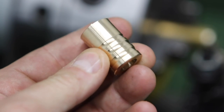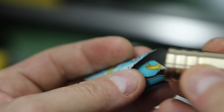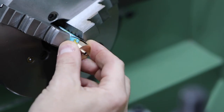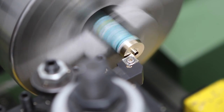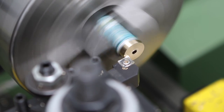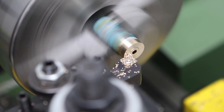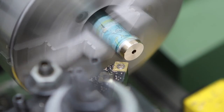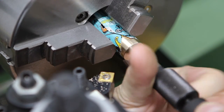As you can see, the parting tool leaves a bit of a rough finish on one surface and a little nubbin of metal, so we need to put it back in the lathe and face that end off. Because the part is brass and the chuck jaws are hardened steel, I don't want to mar the surface, so I've wrapped it in a little bit of aluminium drinks can cut to size — that holds the part without marking it. I'm facing off the end and cleaning up the corner edge with a chamfer tool, then coming back in with the manual chamfer tool for the centre hole.